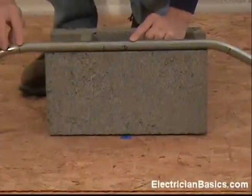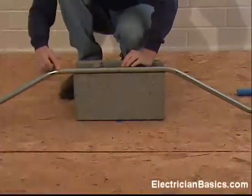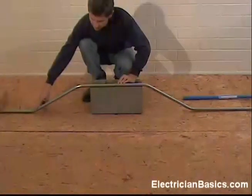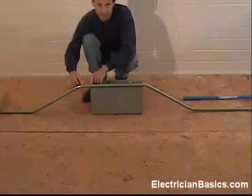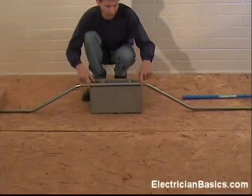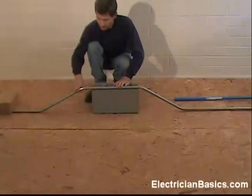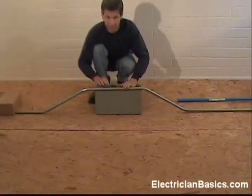If we go further back and look at our saddle, we can see we've got our mark here, and then our first mark over here. You must use the star point when bending like this. This first mark here is 2 inches away from the edge of the block — remember we made it 10 inches instead of 8. Over at this end of the bend we have the same situation: 2 inches away from the edge of our block. Notice how we've got a nice bend from a flat surface, offset up over our obstacle, and transition back down to a flat surface away — and that's what we've got.